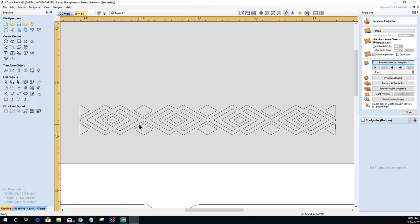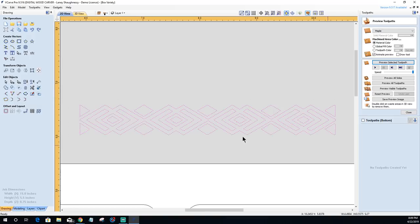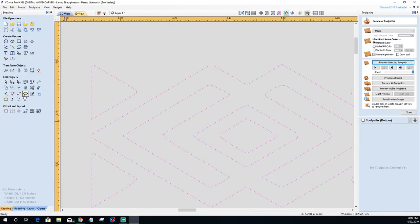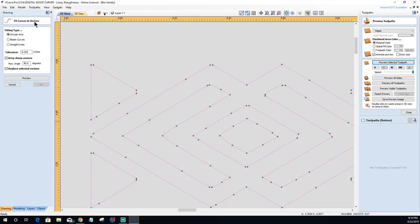Now, there's a couple of ways that I could do this. One is I could actually try my curve fit tool. If I select this here, and let's really zoom in, especially down here, let's see what this curve fit does for us. If I open up my curve fit tool, which fits curves to vectors, I want straight lines, a very tight tolerance, and I want to make sharp corners, okay? But the maximum angle, most of these angles are 30 degrees, 45 degrees, things like that. So I'm going to go,